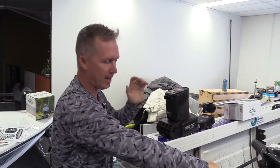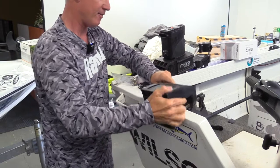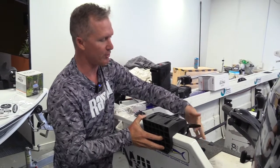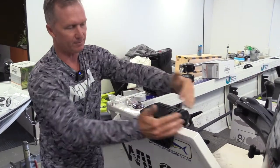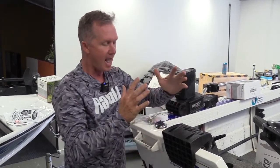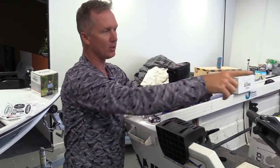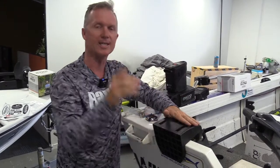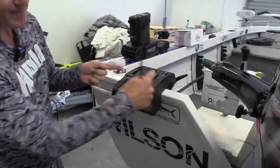Let's see how we put the clamp on the boat. Most tinnies have some available space port and starboard side, and it's going to be a simple matter of picking the side of your boat, picking your location, and like an outboard, you do up the two knobs until it's tight. We're going to be able to move this bracket sideways left and right, because the power pole does hang down at the boat. We're going to find the right side and find out whether port or starboard is most suitable. This boat has a starboard side helm seat where you sit to drive the tiller drive motor, and that may not be the ideal side — so this gives us the flexibility to get it in exactly the right place.